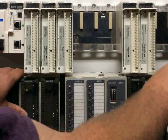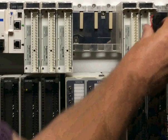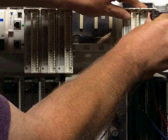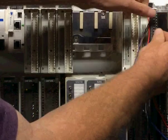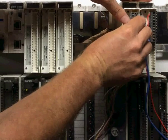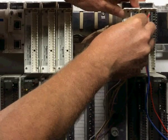The program was executing in the Compact 984, and the same program is now running in the M340. Remove those terminals from the Compact and insert the terminals in the quick wiring adapters of the corresponding X80IO modules.